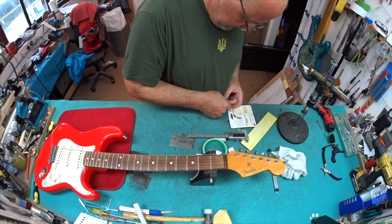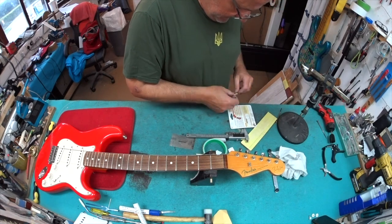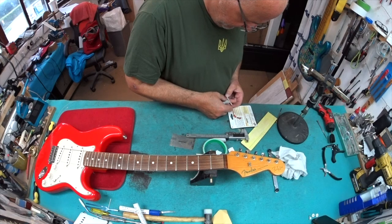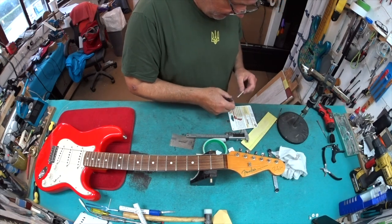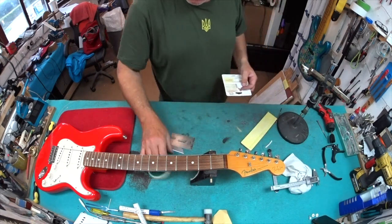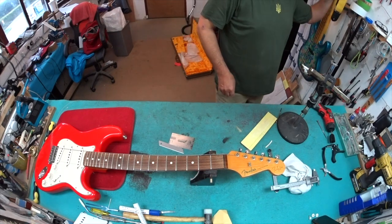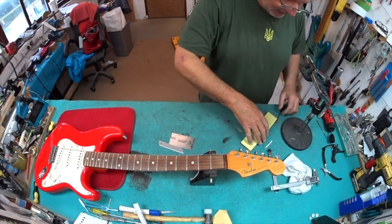I don't want anything to interfere with the measurement, because this thing about getting it to the right first fret action from the bottom up is very precise. And you can see in many ways why I really did like, and I probably will do again, using adjustable nuts, making adjustable nuts, even for Strats, and I stopped doing them recently because, sorry, that all should have been an overhead shot.